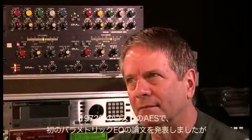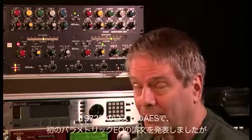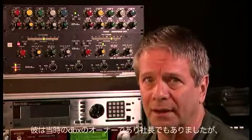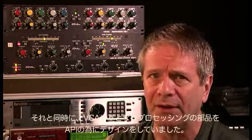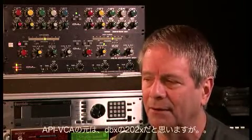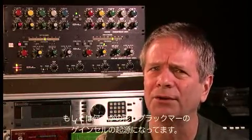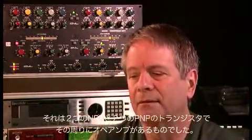At the AES convention in Los Angeles in May 1972, I presented a paper on parametric EQ, the first paper on parametric EQ. And at that session, I met David Blackmer. David Blackmer was the president and owner of DBX, but also had designed the VCA and some other key pieces of processing for API. The API VCA in its original form was a DBX 202X, I think, or some derivation of the original Blackmer gain cell, which is 2 NPN and 2 PNP transistors with op amps around them.